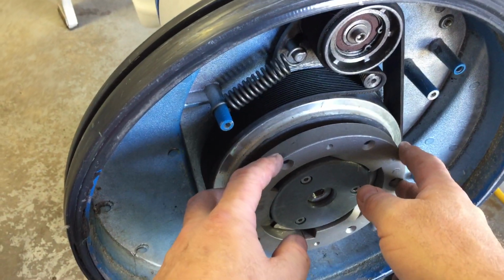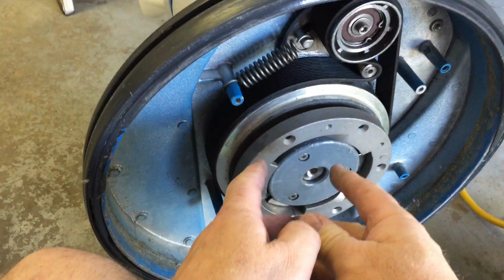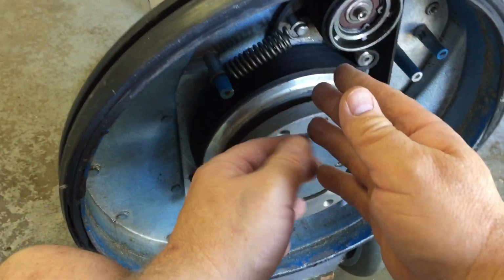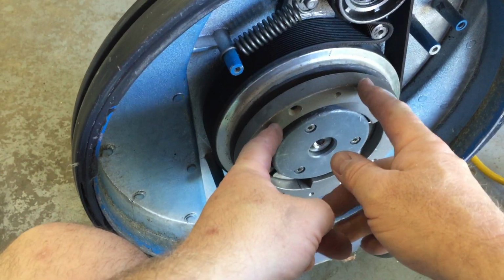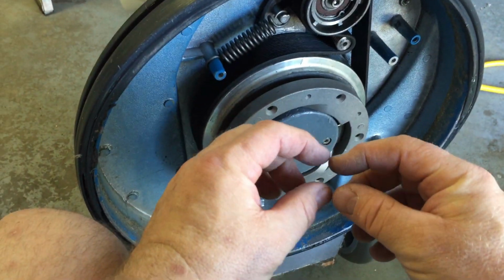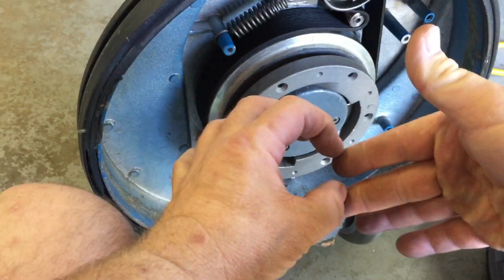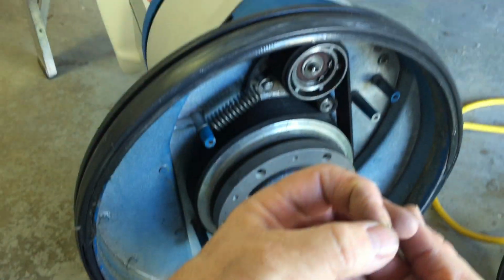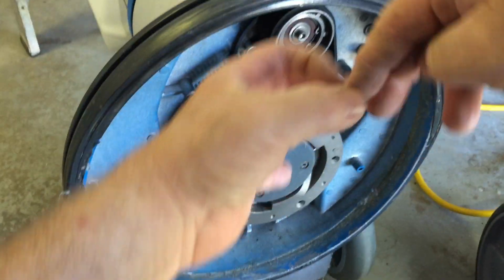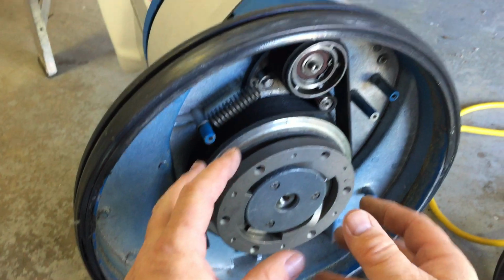But anyway, or there is actually a safety fuse, as it were, in machines with the transmission. This machine does not have it because it has the belt. It looks like a little disc with a little flat spade in the middle of it. One half goes up into the spline of your motor shaft, and the other half goes down into the spline in your transmission. And it's meant to snap.